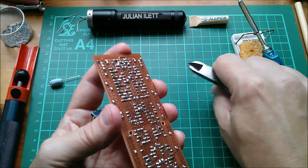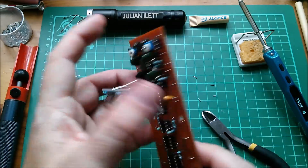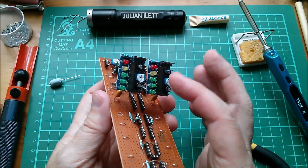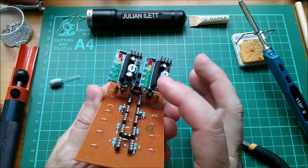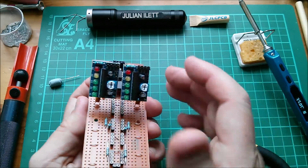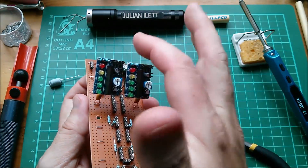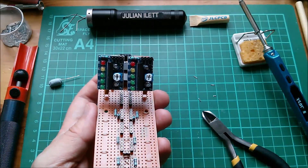That's all my 12 PPMs. Now I'm just a little bit concerned because these are in bar mode and you can't put these in dot mode. There isn't a dot mode facility on the single in-line chip — this is the KA2284 I think it is. So it's bar mode. So when they all light up, all 12 of them with all LEDs hit the top, that's going to put quite a strain on the 5 volt power supply.